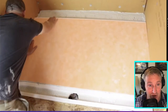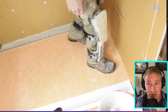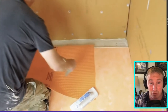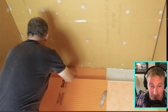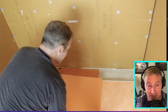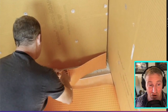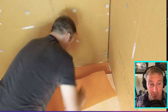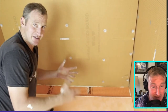A Schluter channel drain going from wall to wall means you won't have issues with water coming out of that area. What's really great about Schluter is that you can easily dry-pack any areas you need to fill in. This is actually my personal home shower — same scenario where I took out the three-quarter inch plywood within the shower area and installed the pan. It was a four-foot-long shower so the pan came 38 by 72 inches and I had to cut it down to fit, then dry-pack the extra area with Ditra and Kerdi membrane.